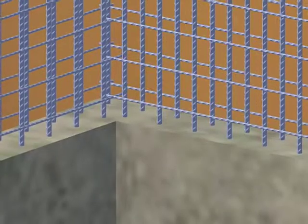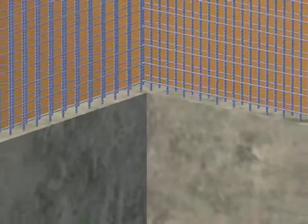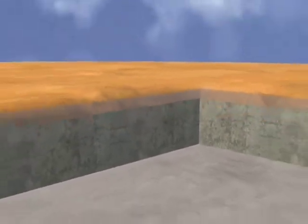To seal the horizontal joint between two successive lifts of a wall, water bar should be laid on top of the horizontal surface of the wall which is already cast. After laying Dr. Fix-It water bar, you may cast the second lift of the wall.